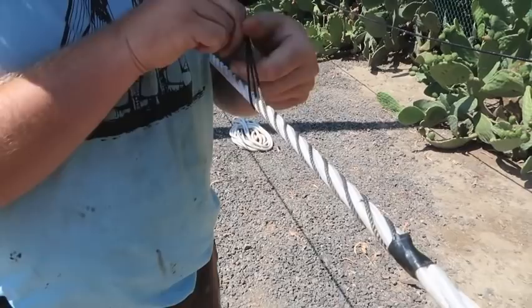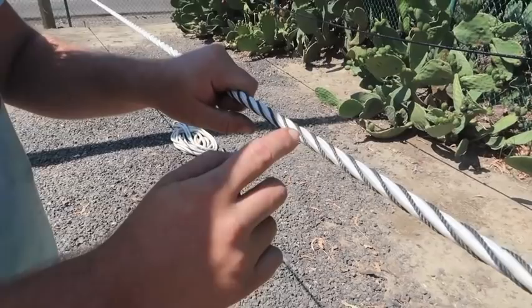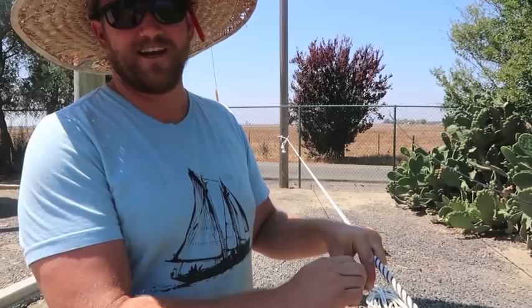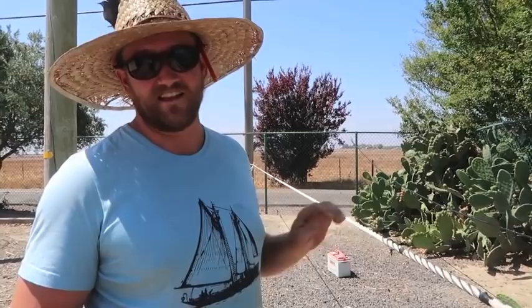Now I understand the concept of worming. It's basically like your fairing wraps. We tape to parcel and then serve it with twine — make it like a solid tube. It's just going to be nice and round and there won't be a lot of gaps. If you just wrap the twine around and left these gaps, that would be a void in there — just like in woodworking, when you're bedding something, you don't want voids. It's going to hold water. This process protects against chafe, weather, and it's almost waterproofing by the time you're done. It's wrapped so tightly and then it's painted at the very end — pretty much completely weather sealing. Pretty impervious.